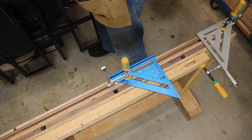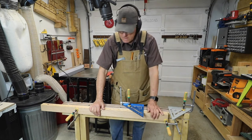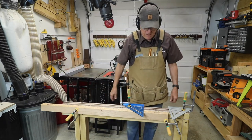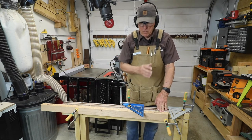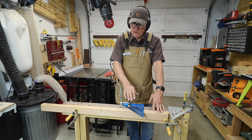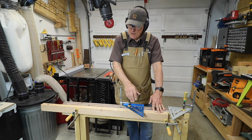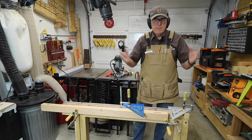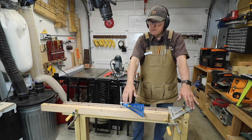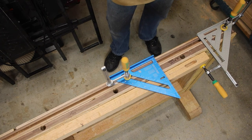I would then simply take all of the pieces where I'm going to have an identical mortise and just take this piece out, leave all this the same, put in the new piece, tighten everything down, and do my mortise. Put in a new piece, do my mortise — maybe I do that eight times or something — but I never have to change my setup after that first one. So: no template, no bushing guide, no wide base keeping me from getting a deep plunge, no clamping problems, because I've got every possible clamping configuration. That is how I use the Small Workshop Guy's Saw Stallions to cut a lot of really nice mortises.